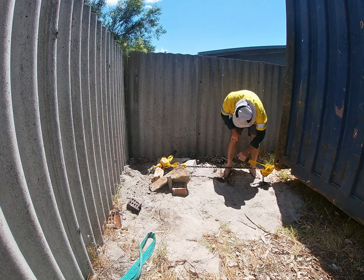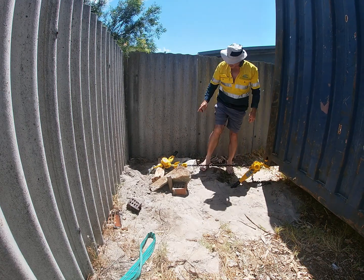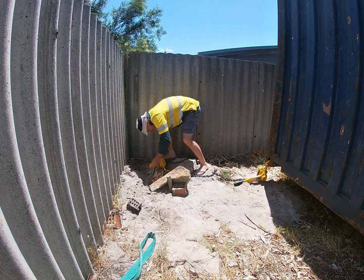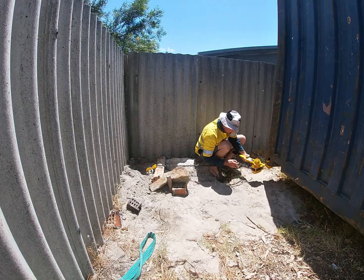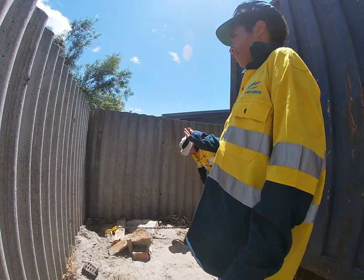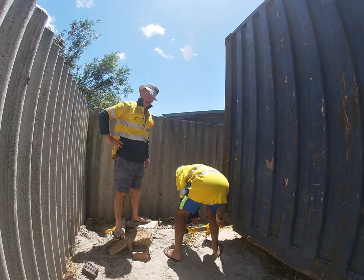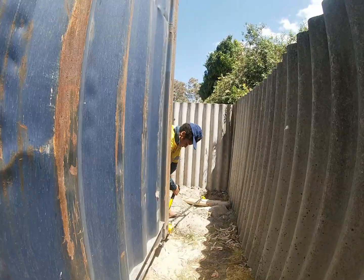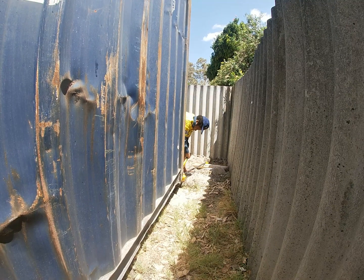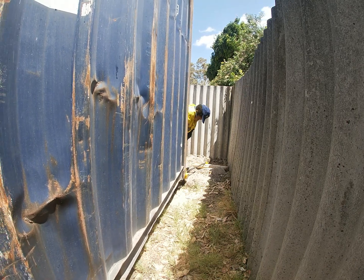For the last three metres in towards the corner there was nothing to pull off, so I concreted in a pulling point into the back corner of the backyard. We had a little bit of drama when we pulled it out but we reconcreted it and were able to get that last bit of movement to get it exactly where we wanted. For the last hundred millimetres I swapped to the smaller come-along just to get every millimetre out of it. Using the trolley jack to reposition the logs, you can get any movement you want — hook from a different corner to pull it sideways, then use the trolley jack to reposition the logs on a different angle.